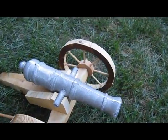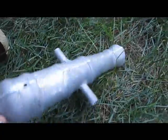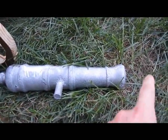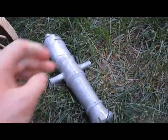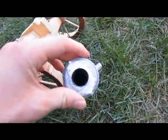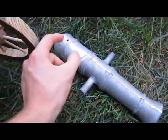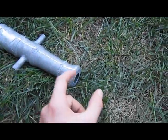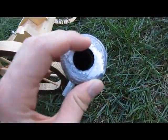I have this aluminum cannon barrel that I've cast, and I had this barrel sitting around for a while. I had originally intended to cast it hollow with a steel pipe as a core, however the pipe had filled in with metal because I had only put a sand plug at the very end of it, and the pressure of the metal had forced the plug outwards. So it wound up being solid with a pipe just cast inside of it.